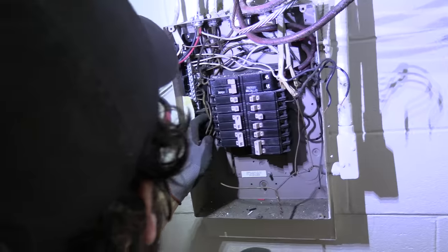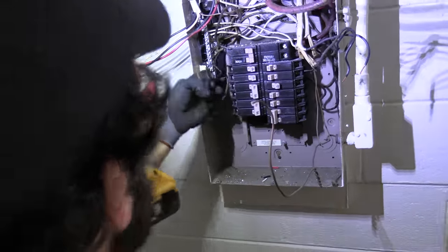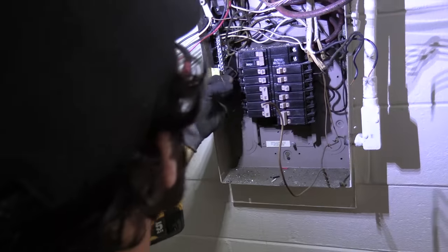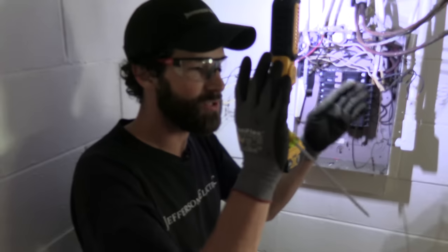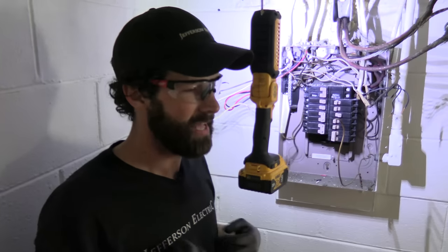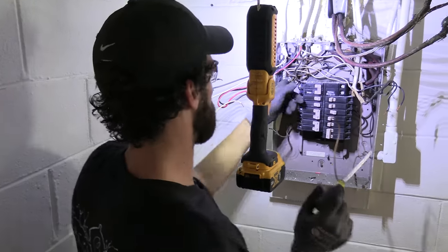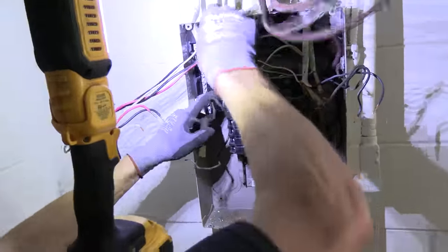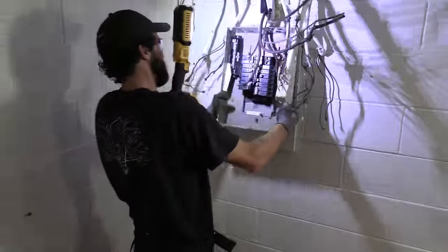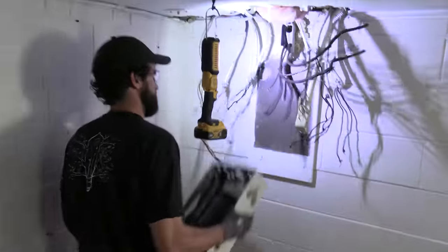This is one of the most important steps. It's easy, but in that regard, it's easy to get it wrong. Any grounding system that's old, like this is potentially original to 1959, I'm not gonna count on those ground rods. They're gonna be so deteriorated by the acidity of the soil, at least in our jurisdiction. I think the conductivity is probably substandard, so we're replacing it. New grounding system, ain't gonna count on anything that's in place in that regard. All of this is trash.